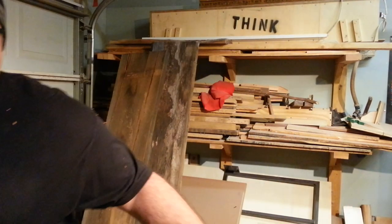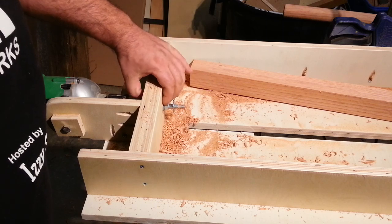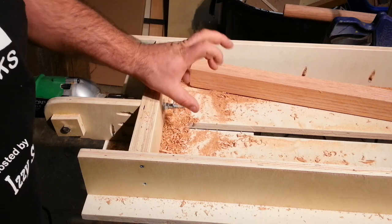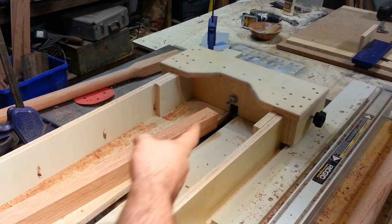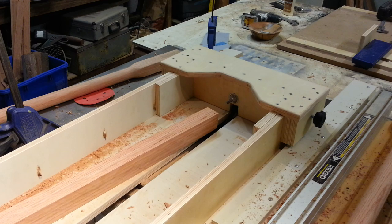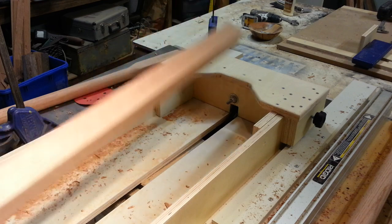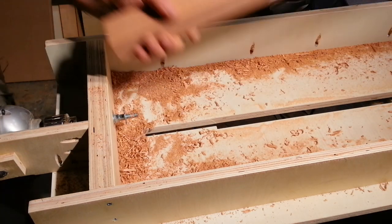This is the jig right here in front of you. I just have a drill attached to a 3/8 bolt that goes through two shoulder bearings on this side, with a jam nut here and a jam nut on this side. On this side I've used a t-nut with little tangs — I turned the tangs in so when I thread it on there it grabs hold real good. On the other side, same situation: a 3/8 bolt coming through two bearings with a jam nut, and I sanded the bolt down so it has a smooth shank. On my blanks I've drilled a 5/16 hole, and a 3/8 bolt threads into a 5/16 hole real nicely, grabs a nice tight hold.